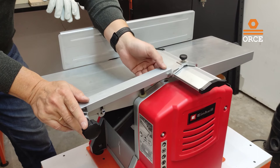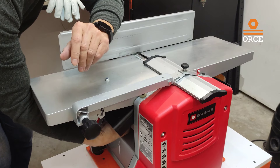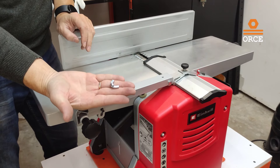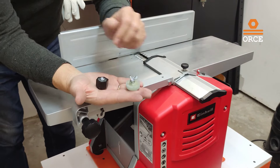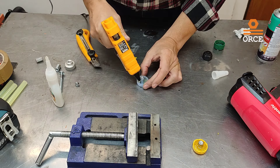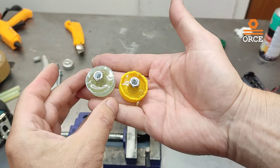If you are planning to use this machine as a thicknesser and a jointer, then you constantly need to remove this part here — removing this nylon hexagonal nut — and you also need to mount this chip extractor very often, meaning you need to handle this small M6 nut. An easy solution is to use a winged nut, but if you have some spare time you can make your own knobs. For this knob I use an M6 long nut, one bottle cap, and a hot glue gun. I simply position the nut inside the cap and fill it with hot glue, and after a few minutes when the glue cools down I have a very nice knob.